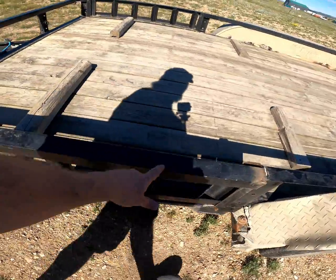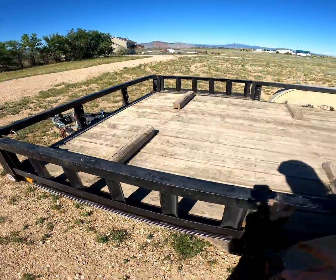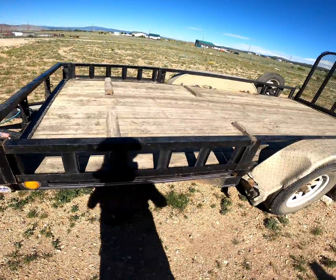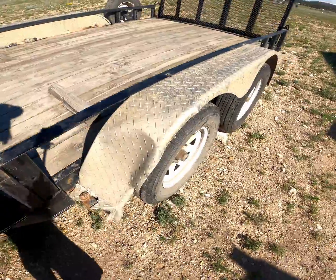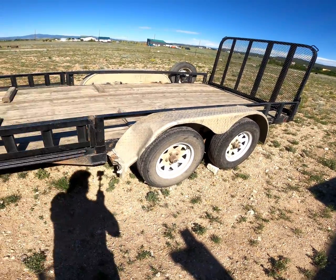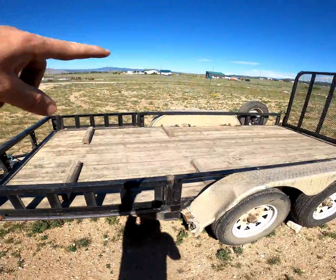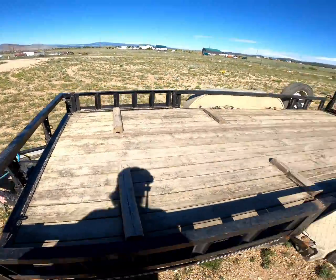But these ramps, this is a ramp that comes out. His four-wheeler doesn't fit in between this opening when you pull the ramps out, so I gotta lengthen the ramps, and I'm gonna have to cut either this side or probably that side, move everything over. This trailer's had a little bit of damage, but you can see the fenders are tied to that. I'm gonna weld those in solid so that he has something to tie those fenders to when he replaces them, because they are mangled. So these will become permanent rails on the outside. Lengthen these. So yeah, I got that.